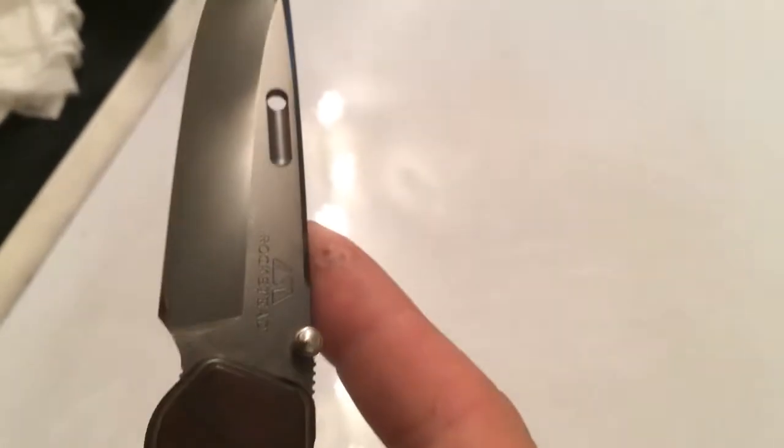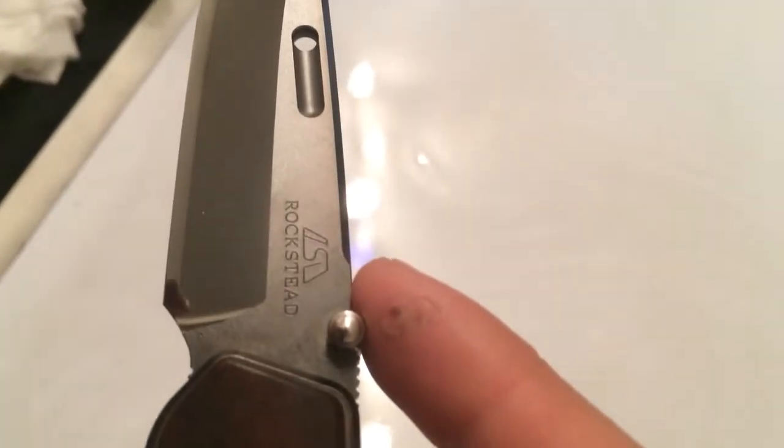Anyways, in contrast with that, you have your Hanzukuri, which does go from 30 inclusive at the bottom to 24. And I know that not only from obviously looking at it, but also from sharpening it. You can just feel the difference in angles when you're hitting the apex. But this does not have the secondary bevel like the Shinogi-Zukuri does have. So you can see some of those scratches there from using it. But anyways,